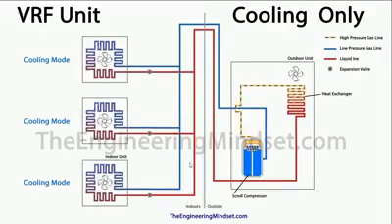As the refrigerant comes in off the common line and passes through the expansion valve, the refrigerant on the other side is now a low-pressure, low-temperature vapour-liquid mixture. As it passes through the heat exchanger and begins to leave the unit, the refrigerant leaves as a low-pressure, low-temperature saturated vapour. The constant force of refrigerant entering the loop forces it to circulate back into the scroll compressor, where it is regenerated and pushed out again to complete the loop.